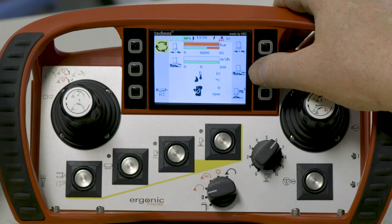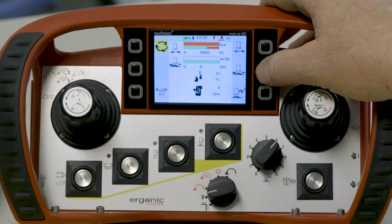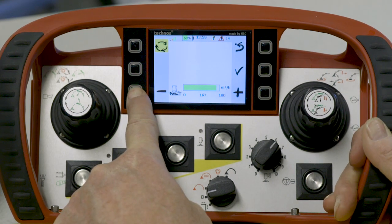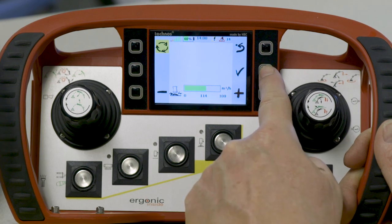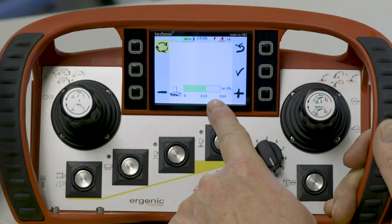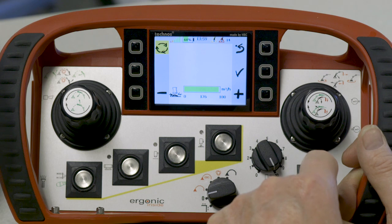For pump speed: with this particular core pump kit, we have available 180 meters per hour. If you want to do less — say 114 meters per hour — you select it and enter. Now while you're pumping through the day, even if you take your dial to 10, the output is limited and won't do any more than that throughout the rest of the day. When you're done, push the upper button and it resets back to factory defaults at 180.